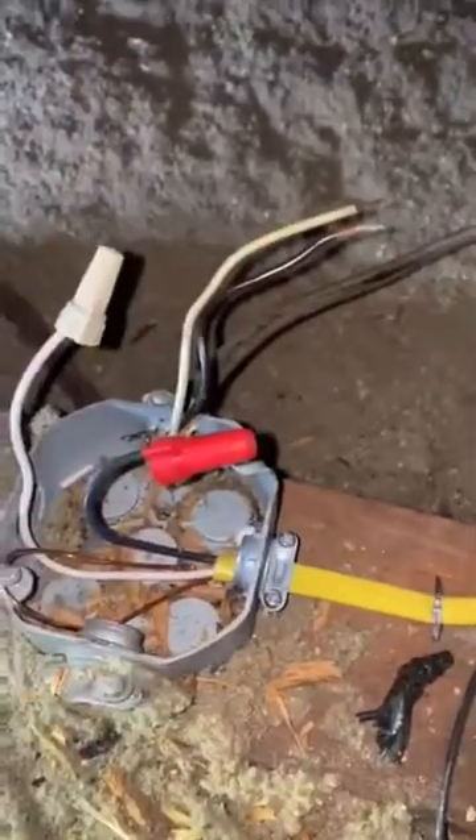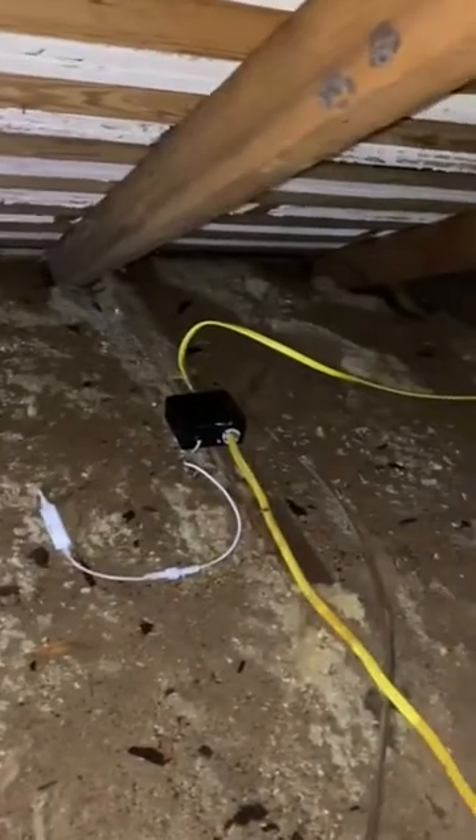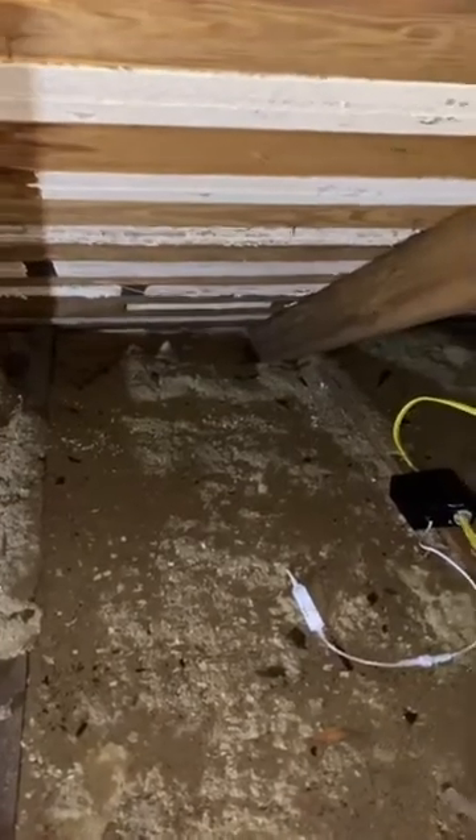The holes are made — that was behind the router, replacing that outlet as well. This one over here on this wall, and the one that was for the AC, being replaced with a new one, and the one up there. Now it's time to go up in the attic, drill these holes down, and pull some wire. Here's the attic where the junction box is. I already removed the one that was going to the router. This one is going to where the AC was plugged in. And over here I've got to drill a hole down to get to the new outlet on the wall.